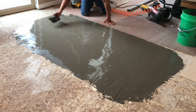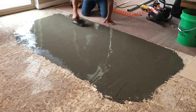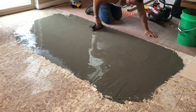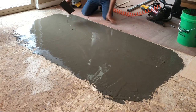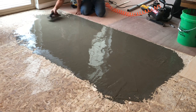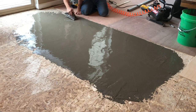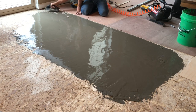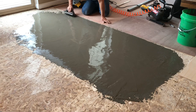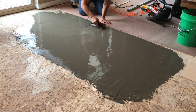We've got about a half inch filled in in some areas at the center of this pit. That dip is probably gone now, especially with that bucket spilled up in there. I think I've covered everywhere within my outline. If you didn't catch the beginning of the video: I made an outline of where the dip was using the leveling bar — that's really important so you know where to spread and where to stop, because the last thing you want is to put leveler somewhere you don't need it. This is my hands-on method and it works.